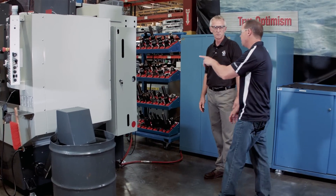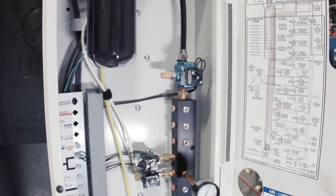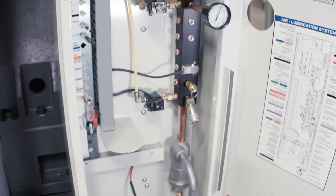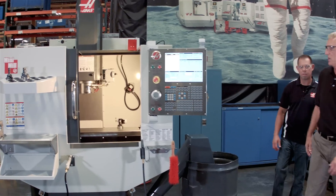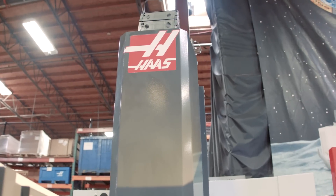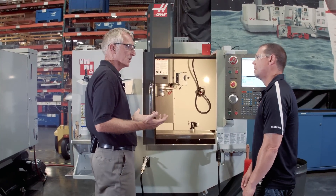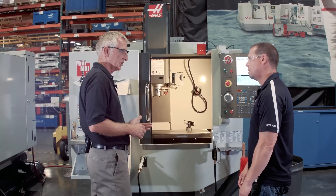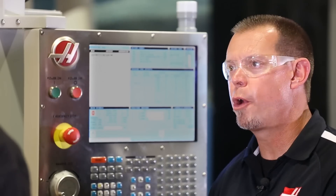Something I'm used to seeing on the verticals and now I see on the Mini Mill is this lubrication cabinet. The min-lube system is really the heart of our reliability efforts — it's on all the VMCs. You don't have to add oil every three or four weeks now; the grease lasts for a year. We've got the solenoids out of the head and brought them down here in a cleaner environment — easy to get to, everything visible. We have our new air pressure sensor on there and all the color coding. Everything kind of looks the same, but really we've touched every part on the machine. The head cover is re-plumbed and re-wired for the min-lube system to get more coolant flow to the tip. The cable carrier on top is different from the old tube — makes it more reliable, more room, easier to run things. All the fasteners you can see now are quarter-20, not 10-32. We have the new Haas Interlock — a very simple device that works great. Everything we could think of to improve, we touched.